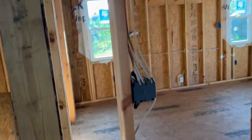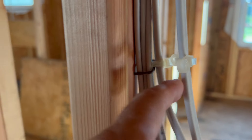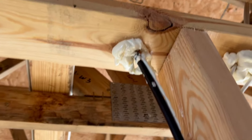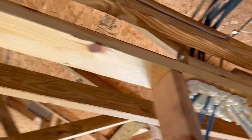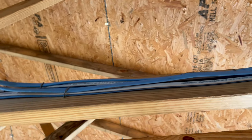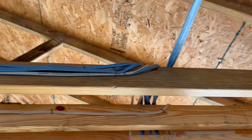Got some sconce lights, but always wiring nice and neat. I've got three here, then I added another one — that's okay. Only three wires per hole when you make a hole in the top plate. And again, don't put your low voltage in the same hole as your electrical — that's why you'll get buzzing. Look at all these wires going up through here. You can always staple it up towards the top where there's no drywall going — staple it up towards the top.